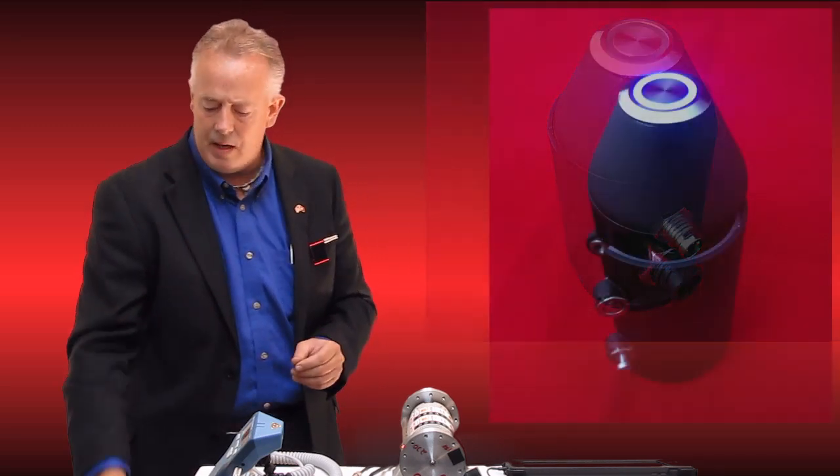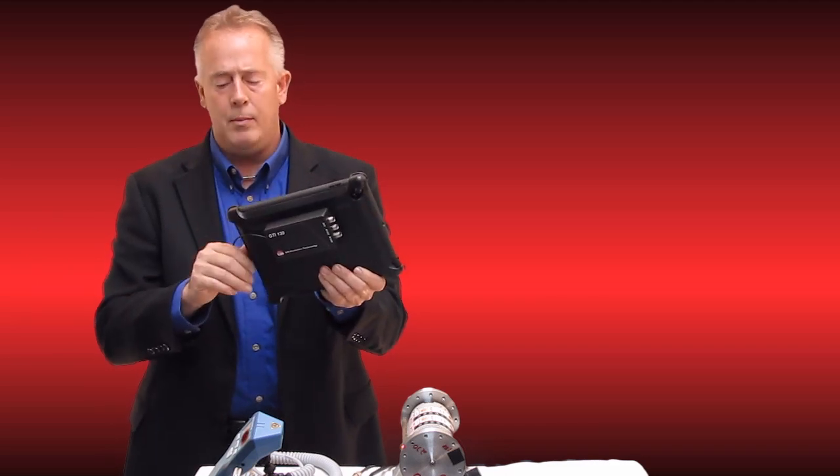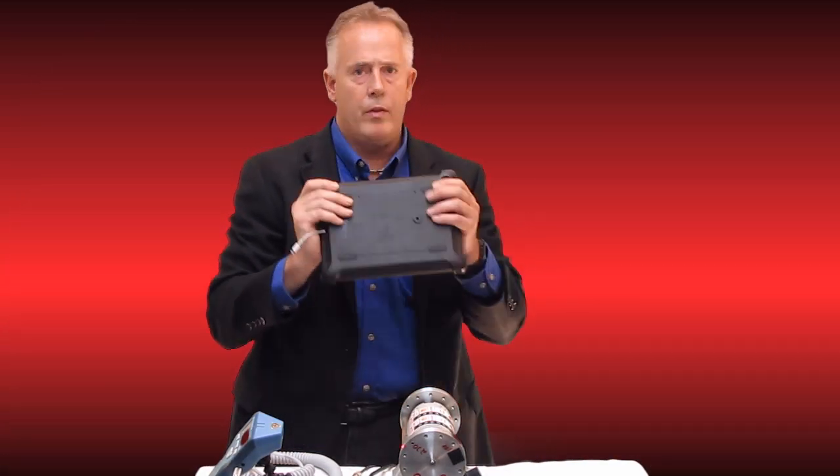For people that have not seen our other videos, I will show you on the iPad what our traditional DAQ unit looked like. This is a standard iPad still in its industrial case, and as you may remember, this is our three-channel box that we had on the back, tethered to an accelerometer or a tachometer. We are now able to remove that part of the device — we simply clip onto our back panel with nothing on the back anymore, with the wireless receiver built inside, and we're able to pair up to a hundred of these sensors if necessary.